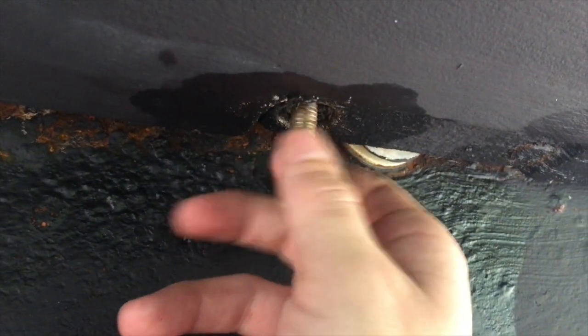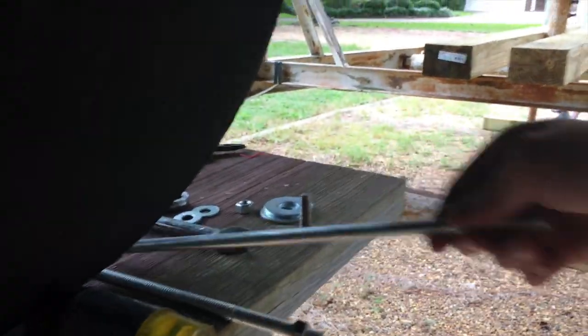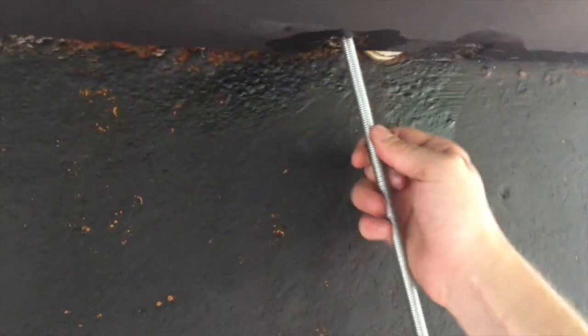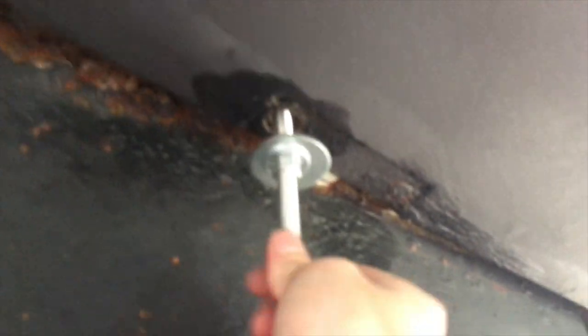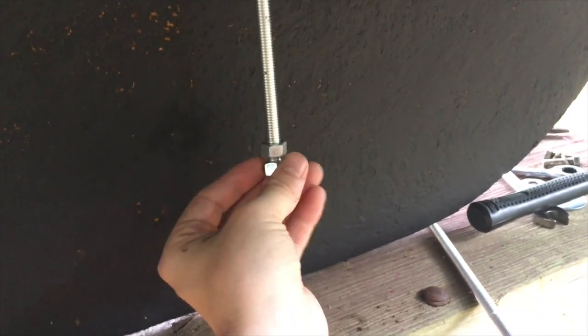So what I'm doing is I'm lowering the keel here. There's two screws on this side, two screws on the other side. I'm pulling these screws out and replacing them with these. These go basically inside of here. We're going to put a washer and a nut on this, and that way we'll be able to lower the keel slowly because it weighs 1,500 pounds. So now that I have that there, I'm just going to screw this in all the way. I have this nut on here and then I'm going to screw another one on.